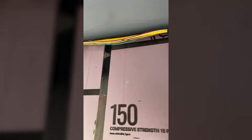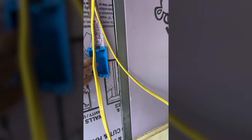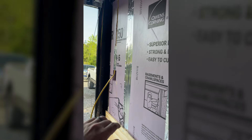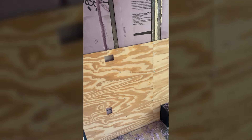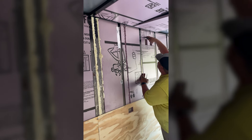Got the wiring process started. All we're doing — I don't have any walls here yet, but I know my breaker panel is going to be in this area — so we're fishing all our 120V wire through the insulation and then zip tying it to the top to keep it out of the way. I'll have a piece of one-by-four trim at the very top ceiling once it's finished to cover that up and give easy access. Got our boxes in place — those actually fasten to the outside of the plywood. Got a receptacle here and a receptacle there where our queen bed lets down out of the ceiling, so we'll have phone charging ports. Got a receptacle at the prep table for when we do contests — that's where we'll do all our trimming and box building. We've also got a coax box and another receptacle in case I want to hang a TV right there.